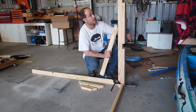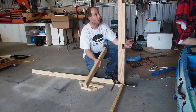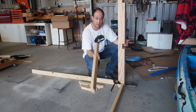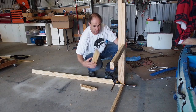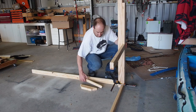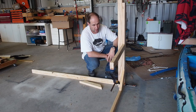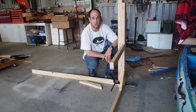This is the right-hand side done. It's exactly the same on the left-hand side, so everything is done. All that has to happen now is to put it together — that's pretty much simple. All my mate has to do is slide in all these little rebates that I cut, glue and screw that in there. It's a bit of overkill in my opinion, but I'd rather over-engineer it. Glue and screw each rebate — one on the bottom, one on the top — and that's the job done.